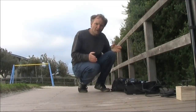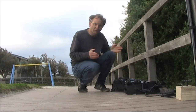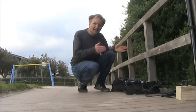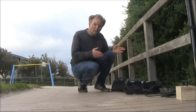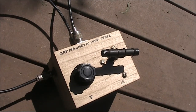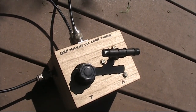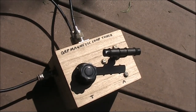With the low sunspot cycle, there are a lot of times where just having 7 to 28 megahertz is not good enough for portable operating, even during the day. That's where a loop like this can be handy, giving you 3.5 and 1.8 megahertz capability with only a roll of coaxial cable and the loop tuning unit. MFJ sell them commercially in both high power and low power versions, or you can build your own from plans on the web.